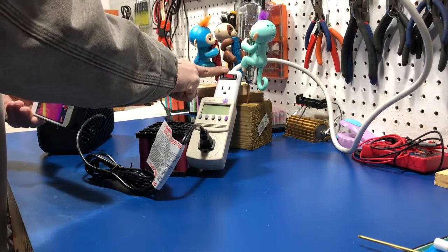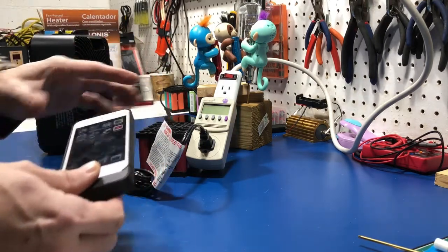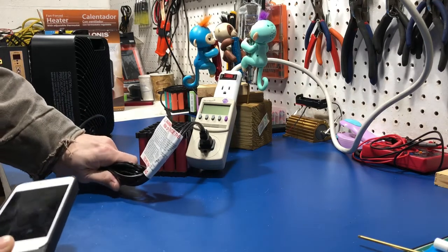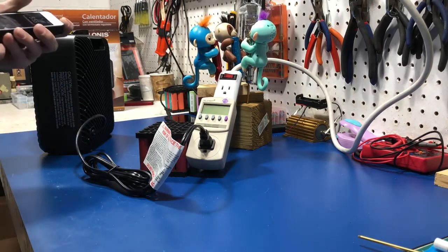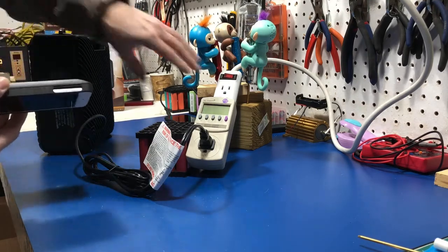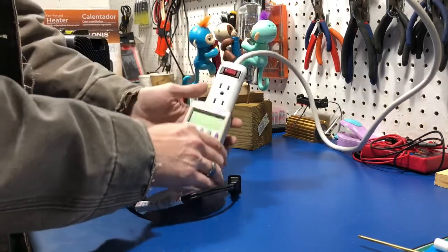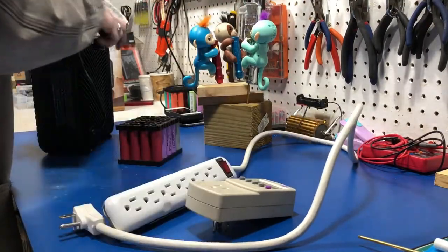The wattage is dropping — and there it trips. One hot spot is reaching 107, 109, 110 degrees. It just shot up in this one little spot right up here. That took 11 minutes. Last time I did this it tripped within 4 minutes — I didn't expect it to take this long. But even rated for 1800 watts, we have something going on: at only 1450 watts it's tripping earlier than it should. I hit the reset and it comes right back on.